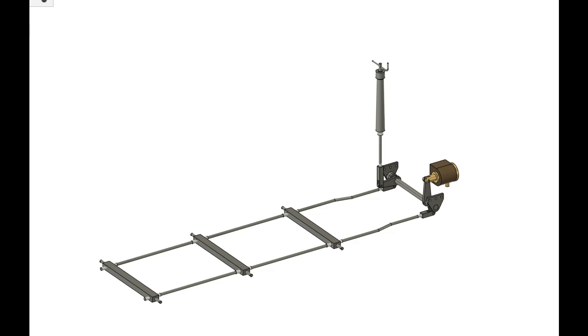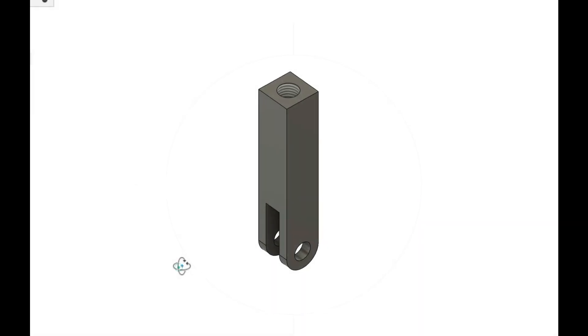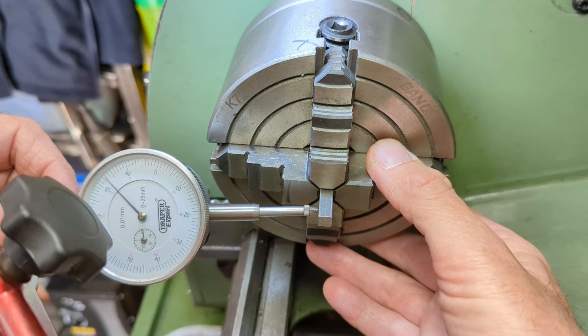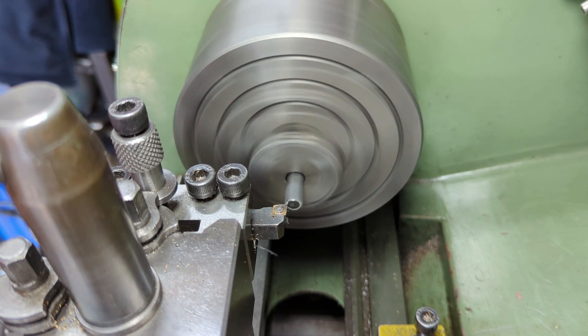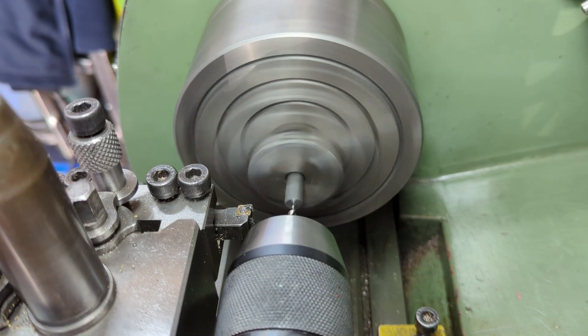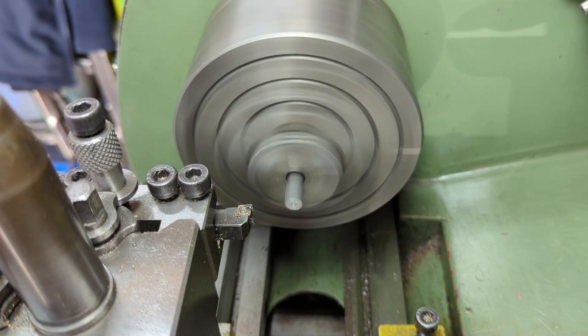Those projects aside, it's high time I finished off the brake gear on this loco. To do so I just need to make the brake nut adjusters and the brake pull rods. I'll start with the brake nut adjusters — there are two at 17.5mm length for the pull rods and one at 28.6mm length for the handbrake. I've covered all the various machining operations in other videos in the series, so I'll keep the narration to a minimum.